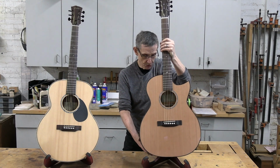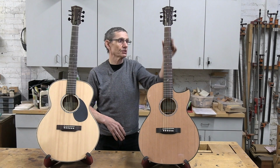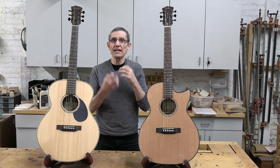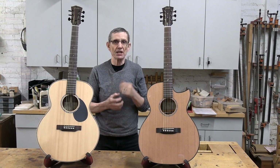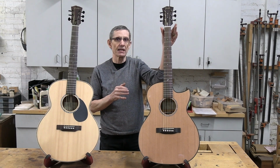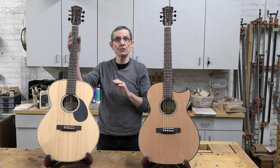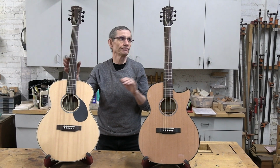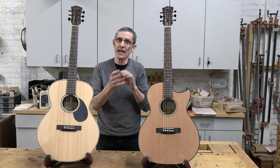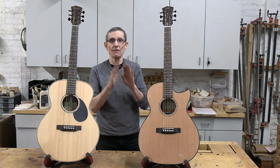But what I like to do on my guitars is a semi-gloss buffed finish on the neck. It's kind of a unique finish in that by doing it with the buffer and using a specific type of compound, I get a really silky feel to the neck that you would get when you rub to a satin sheen. And it's a little bit higher sheen. It's in between a satin and a gloss, what we call a semi-gloss. It looks and feels fantastic.